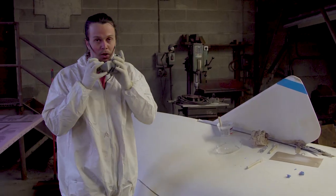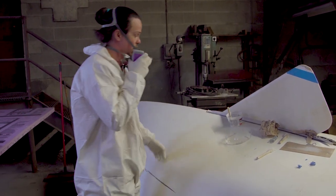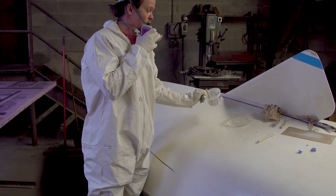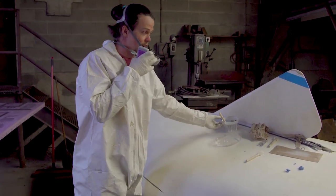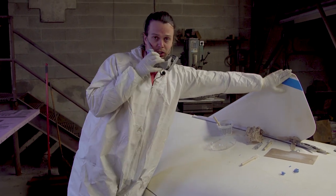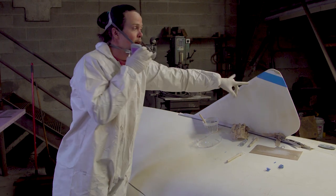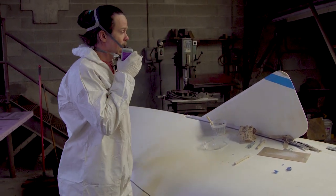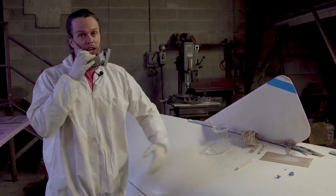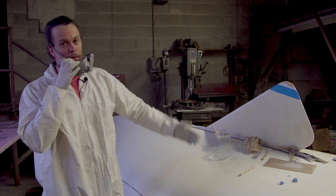All right, blockheads, we're now gonna do the final step for this centerboard repair, which is apply our gel coat here. I pre-mixed some gel coat, and it's actually been sitting for a couple of minutes to get to the right viscosity because we're applying to a vertical surface here. Really have to worry about sag. I've over-taped here, and we'll apply it in really thin coats this time, and might have to do a couple of different passes to get it to the right thickness, but because it's a vertical surface, I'm a little bit more aware of how much it sags.